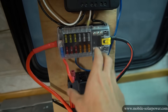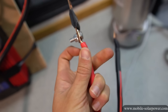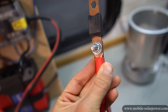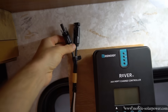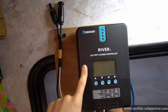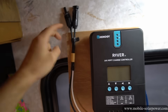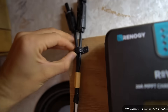For this system a 100 amp fuse is great right here. The fuse should be bolted on so that the terminal connector on the thick cable is flush with the bolt-on fuse — no washers between them, no washer on the outside. You want those two copper surfaces to be flush with each other. For solar panels, if you have an array of 200 watts, put them in series. If you have this MPPT charge controller, put the panels in series and use extension cables fed directly into the charge controller — you do not need additional adapters. What is smart to do is hold the solar panel cables down with one of these little cable holders that you screw into the board.